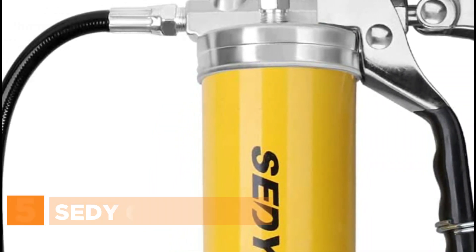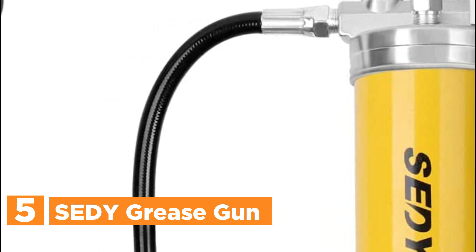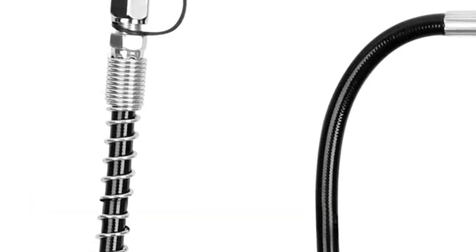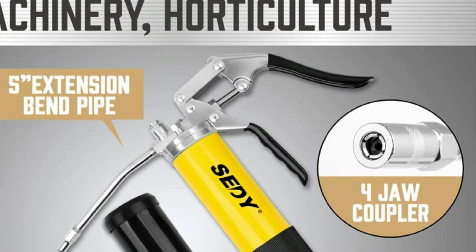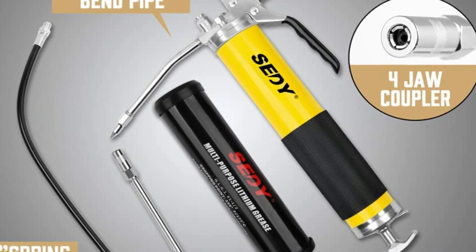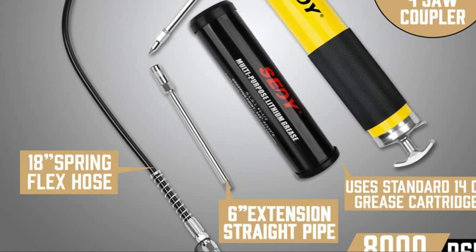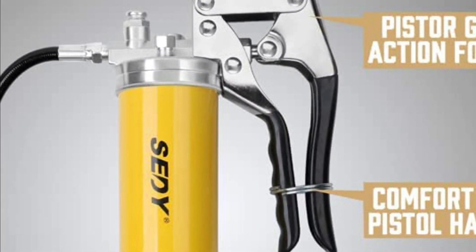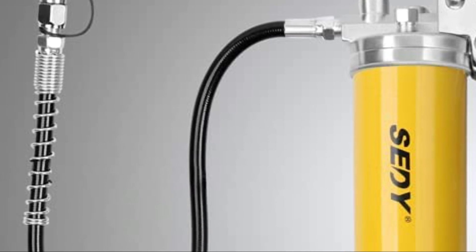Starting our list at number 5, the SEDY Grease Gun. The premium heavy-duty pistol grease gun on the market features a thick-walled, knurled barrel for a secure grip and delivers pressure of 8,000 PSI. It is reliable and ergonomically designed for easy one-handed operation with a pistol grip and 14-ounce cartridge. Push the T-handle down through the press sheet to make the spring work properly. If the grease has not worked, the coupling can be pulled up or unscrewed. It can also be disassembled easily if a blockage is present, which increases its number of uses.